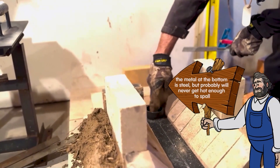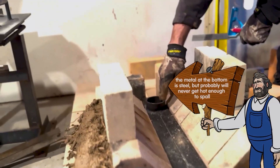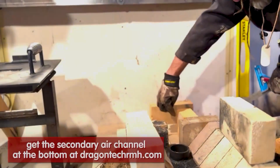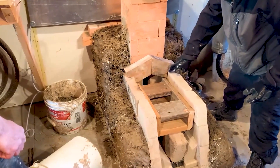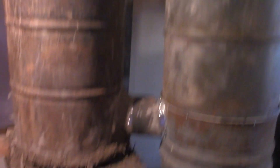That's hooked into the air here — this has secondary air — that sucks air in through a hole in the front door, gets sucked into this riser chimney thingy, and up into a barrel, from that barrel into another barrel. This barrel here is about yay high, and it gets filled with the hot gases.